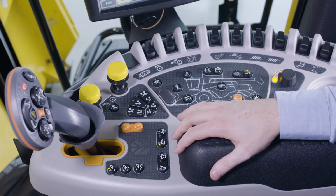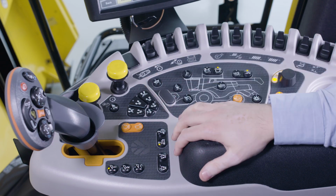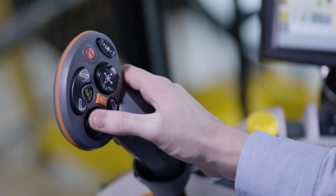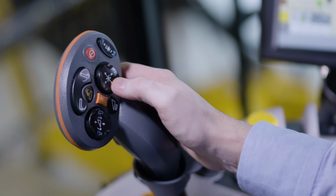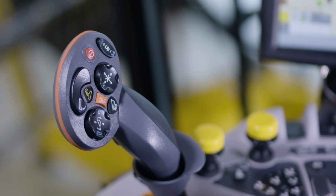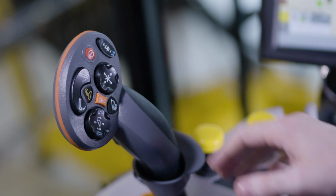You need to engage feeding and threshing to adjust and store the desired cutting height. Subsequently, you can manually adjust the cutter height by pressing the rocker switch on the command grip multifunction handle, or adjust the reel position by pressing the rocker switch on the command grip handle. To store the position, press and hold the resume button on the command grip handle for 2 seconds.